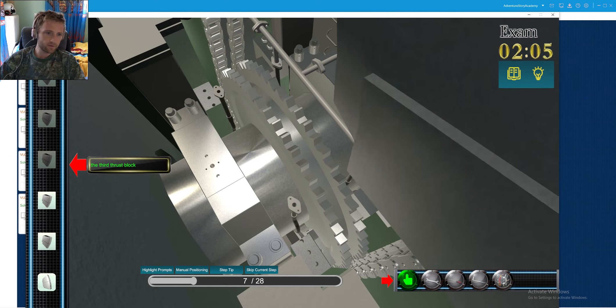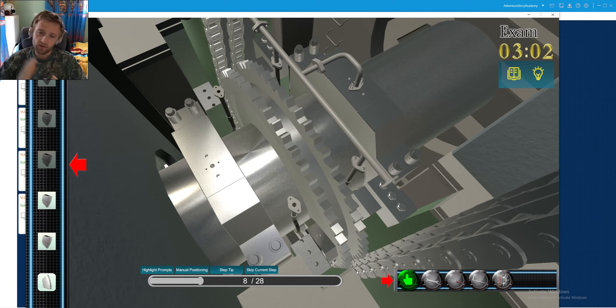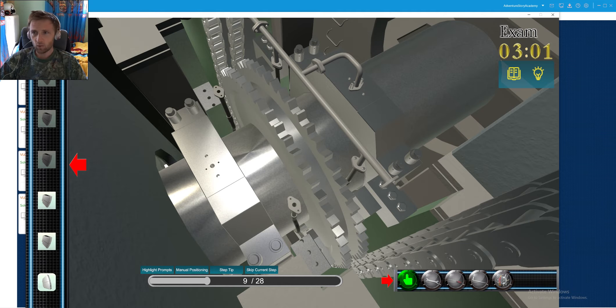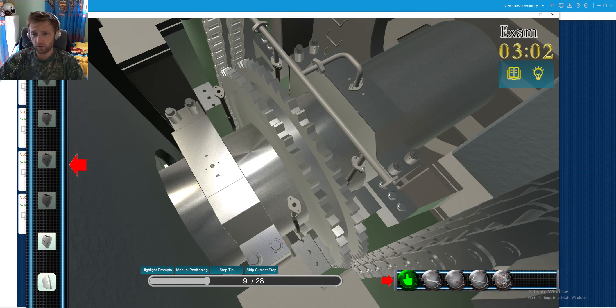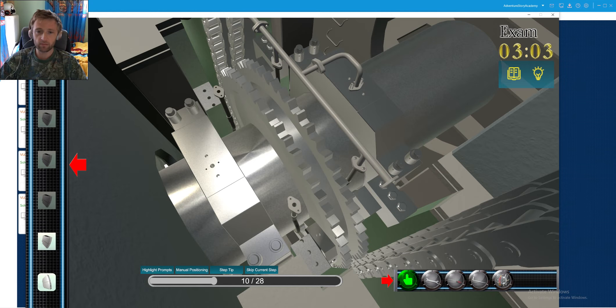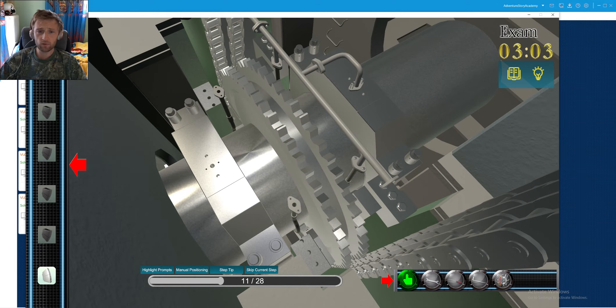As you can see, the segments are specially designed — there are grooves and cuts on the surface so that oil will be trapped between them and kept on the surface for as long as possible, prolonging lubrication and reducing friction. The main purpose of the engine manufacturer is to reduce friction. With a frictionless engine — which is really impossible — even with oil there is some friction, but reducing it as much as possible will increase the life of the engine and its components.